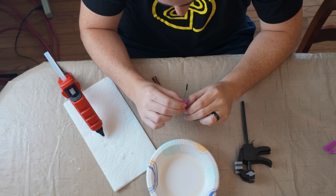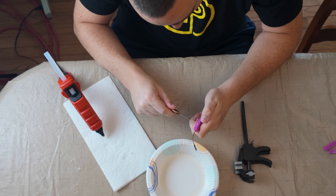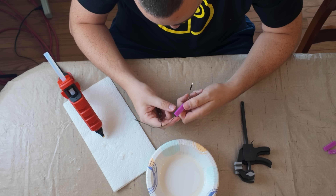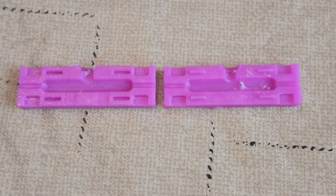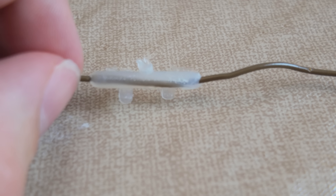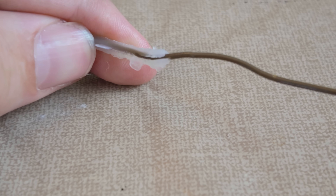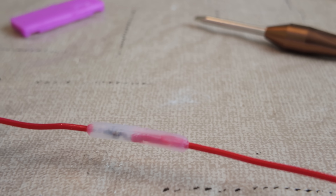It's been a few minutes. I think it's time to pop the mold open and see what the deal is. That corner is popping so much easier already. Very easy to pop off. I would call this a medium success. As you can see the mold came out very clean and there's only a little bit of leftover residue of hot glue in there — I should be able to scrape that out with a screwdriver. This is the injection point, and these were the two air reliefs, so I could easily trim those off with a pair of snips. I kind of tore it a little bit when I was pulling it out, but I think this proves that this is possible. This looks fantastic.